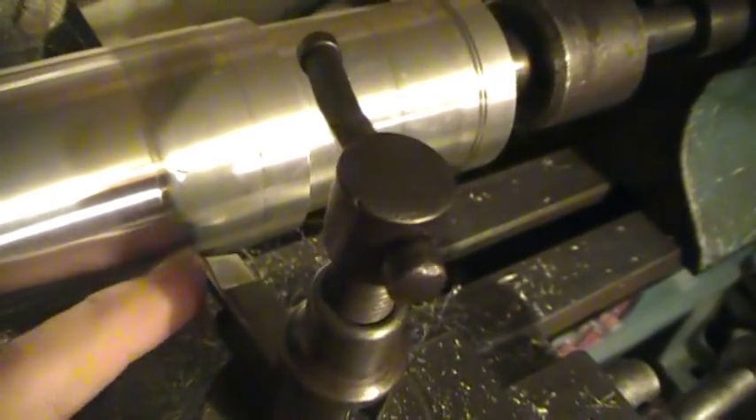I've been cutting with it. Made a big mess — this is definitely temporary, not going to keep it like that. I think it gets a good finish, a very good finish actually if you feed nice and slow. I don't know exactly how fast the spindle is going, but decently fast. Got a decent high speed steel cutter there with a chip breaker and all that good stuff.